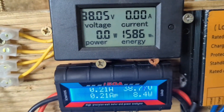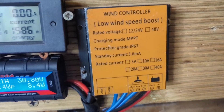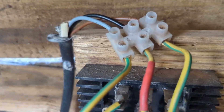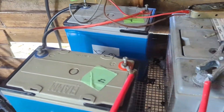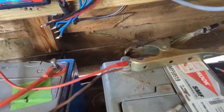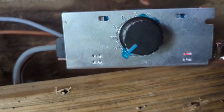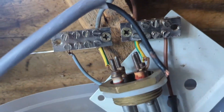Peace. Greetings YouTube. I've decided to add another battery. I've removed this because obviously it won't work with three batteries. The rectifier is now converting the AC from the turbine to DC, and then we just have very simply three batteries connected. We also have the dump load connected still, so when we decide we can start sucking energy out the batteries and they'll go into these two dump loads which I've connected up to this little metal thing.